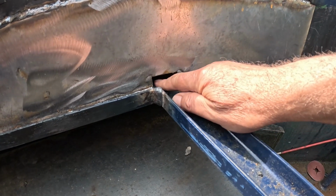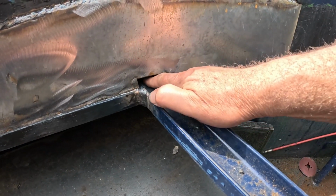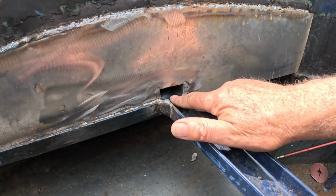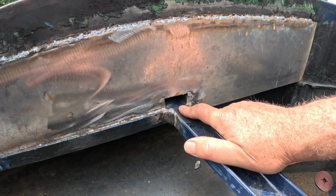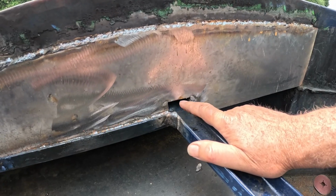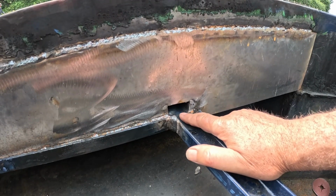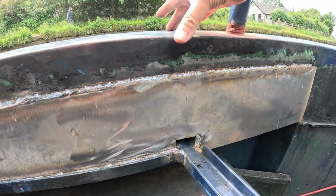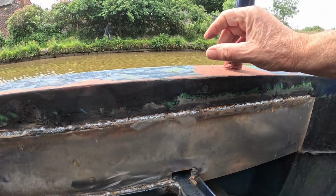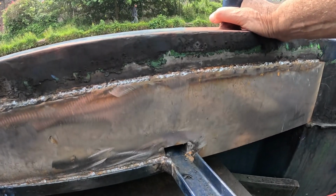And these are the new outlets for the water. It's going straight through the side of the boat here, one each side, rather than those downpipes which kept blocking up before. If I see these blocking up with leaves, I can poke them clear quite easily. There's only a short distance obviously between there and there. I can push a stick through there and clear that out.